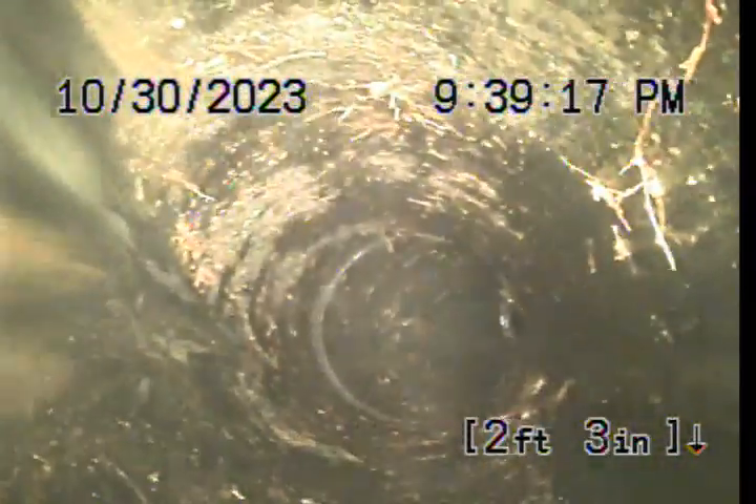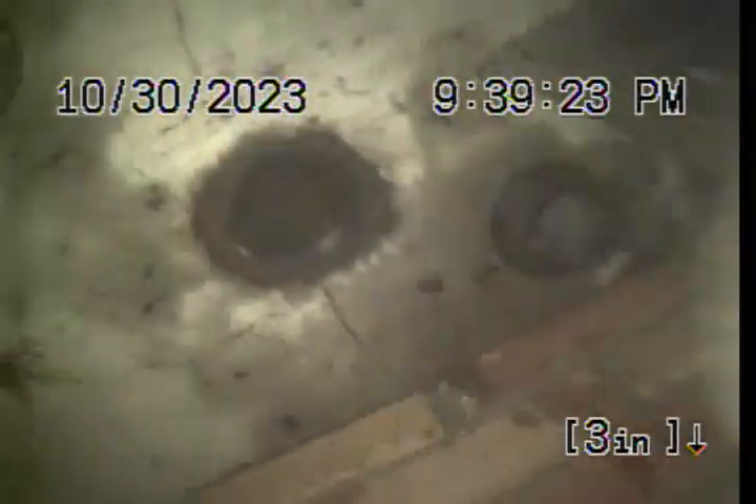It's not clear whether that's a break there or not, but you can see we've got the roots cut flush with the pipe. We worked that again on the second pass with our two-inch cutter to get those cut as flush as possible. Here's where our clean-out ties into the building drain — you can see the water flowing by. There are roots that fell off our blade here. We're pulling up and out of the outside clean-out.